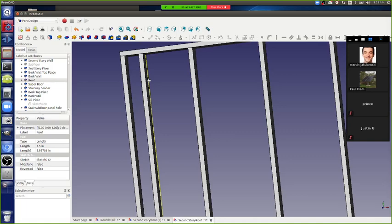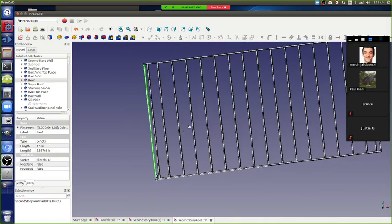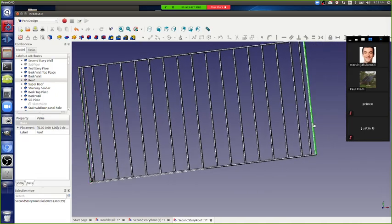They'll be rather stable. So when we're inside the second story without a roof and we're starting to put on a roof, we go from the inside and one by one we start. We might want to start with this one here, or this one here. If you examine the workflow, you can actually have people start from both sides. So you've got a team of two or four people here, which is completely independent from this one here and here, so you can do them at the same time. If you have more people, you can do just about all the corners at the same time.